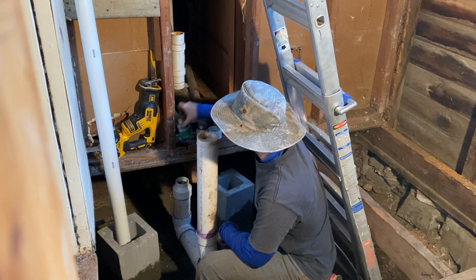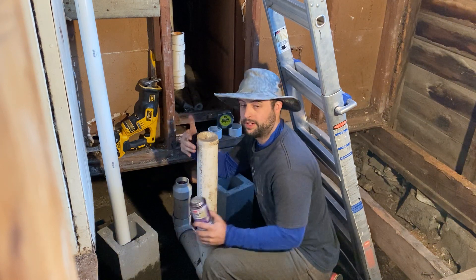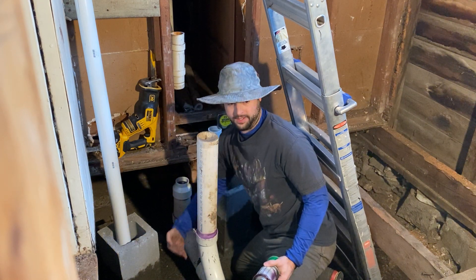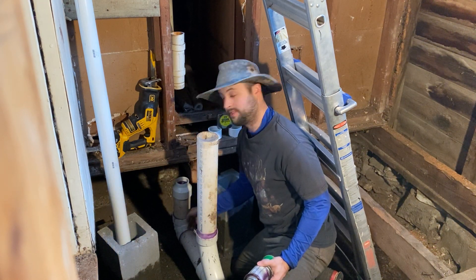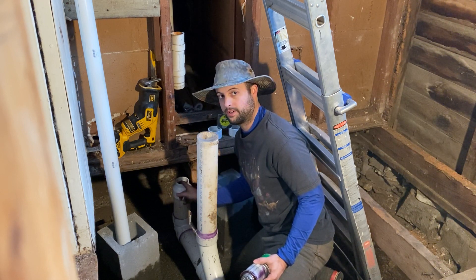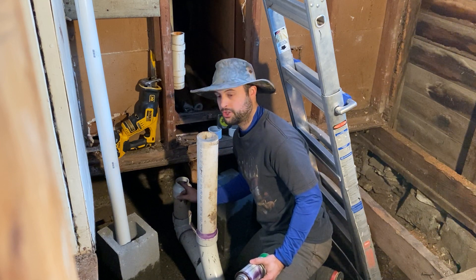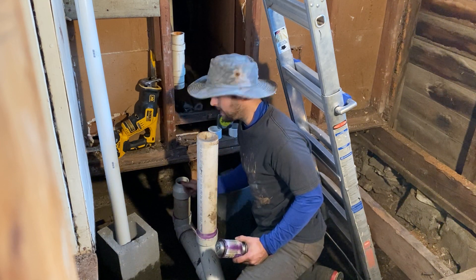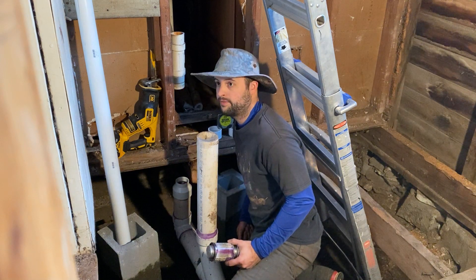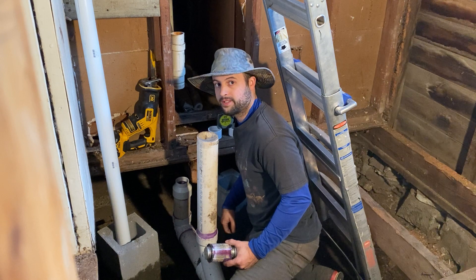I'm going to show you how to vent from a toilet. There's a toilet right here, and it's all draining that way. This is a vent going up, and it's three inch with a reducer — a little fitting that you can get called a reducer right here, doesn't cost too much. You just glue it the same way I'm about to show you, and I'm going to go up through the roof. A lot of toilets and houses have these vents, so this is how these vents are hooked up.